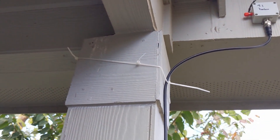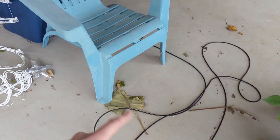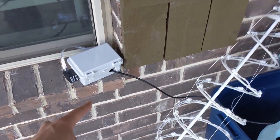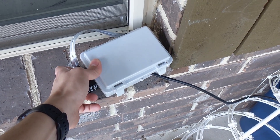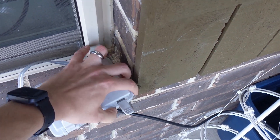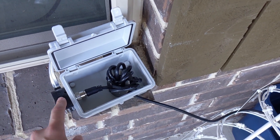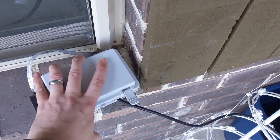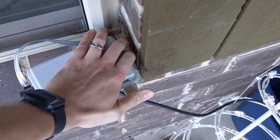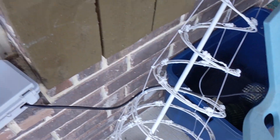As you can see, this is very professionally installed with zip ties — all kind of temporary at this point. This is about 50 feet of coax that runs to this little box I put together. This is one of those Comet window pass-throughs that I'll link in the description. I cut a hole in this little box from Amazon, and this has my ferrite core in there — I drilled a hole in the side for the Comet pass-through. I'll close that, and that way it's as waterproof as I can make it. It goes in here into the office to my radio.